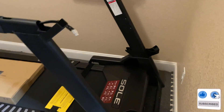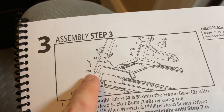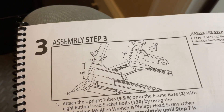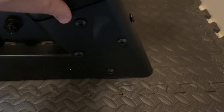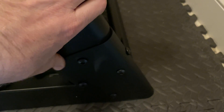Get these four bolts in place on both the left and right mast — make sure you get the two front ones as well as the side ones on each side. To get these in place you've got to finagle the caps a little bit and put your hand under it. You'll need to move the mast around because the holes don't always line up easily. You should be able to screw these in by hand if the mast is in the right position.